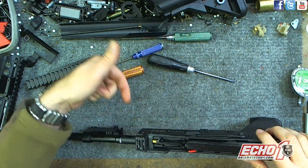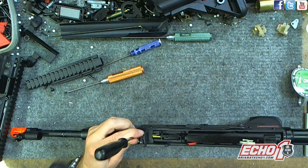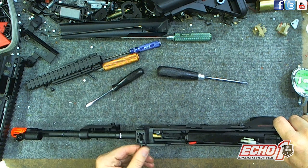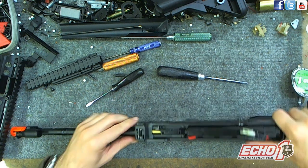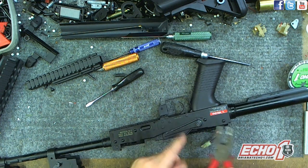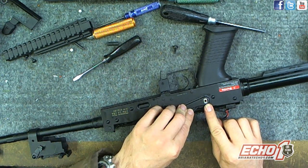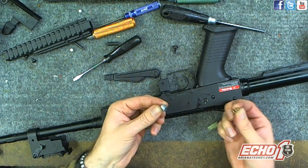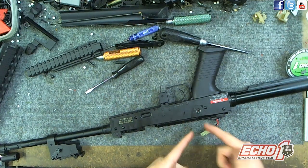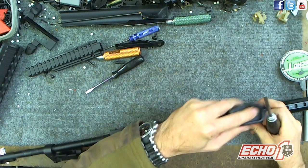For this pin — on the metal ones you punch it clean through, but this one is a little different. Use a small flathead, just tap and kind of wedge it in there and gently pry out. There's not a hole that goes clean through — you could always modify if you want to, but I really don't see the need. Keep the gun on safe, just easier to line it up. Use a pair of pliers — it just twists off and the large screw head comes off. Notice how it's attached in the little grooves and lifts up. You'll notice a little small notch that works with the internal selector plate — keep your selector lever nice and tight, not too loose, otherwise you will have problems in your fire mode.